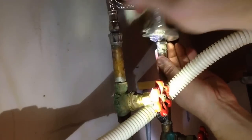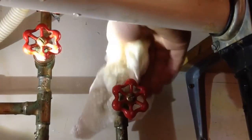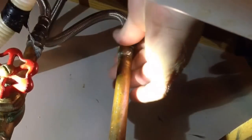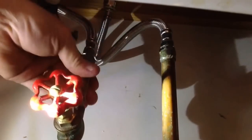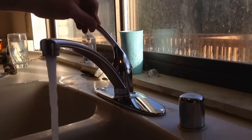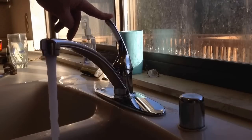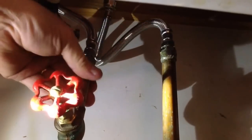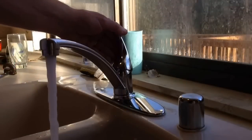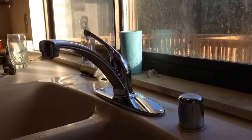Once I get that tight, I can wipe down any spots that might have leftover water on them. I want to make sure everything's dry before I turn the water on so I can check for leaks. I can go ahead and turn my water on. The first thing I'm going to do is feel around for any leaks. That side's dry, so I'm going to turn on the hot, and once again feel for any leaks. There'll be some air in the lines, so once I go back up to the top and turn the faucet on it might spit. You want to run the faucet for a little while before you actually use the water. I'll run it for a bit to get all the air out, then go back down underneath and check once again for leaks just to make sure. Everything looks good — this is how you replace a single-handle faucet in the kitchen. This is HowToBob. Thanks for watching.